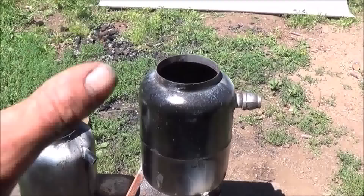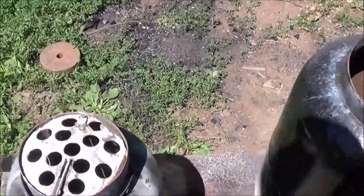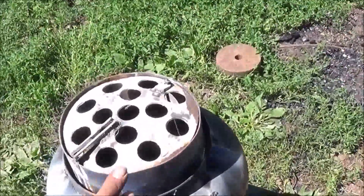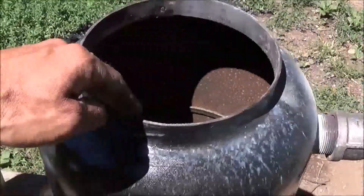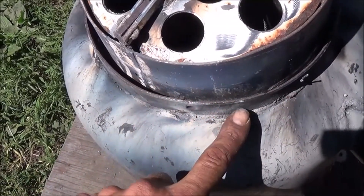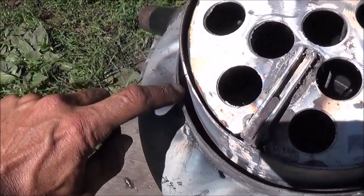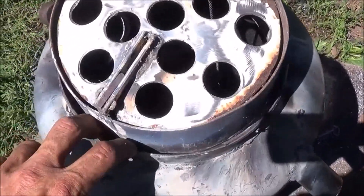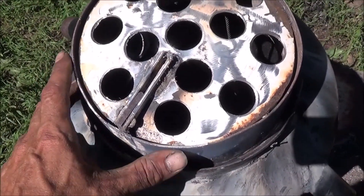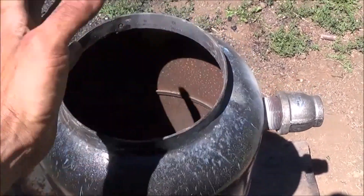We've completed the upper. I showed you how it's sitting down inside of each other. Now I've completed all the seal that we needed to make a nice seal between the upper and the lower. You can see this rim sticking up right here — that was the old ring on the bottom of the propane tank. The reduction zone itself slides down inside of that ring. This ring's lip fits right here. You can see this gap that I've left — that's another one of the rings from the bottom of the propane tank. I've just expanded it, made it wider, and it allows for the ring from this one to sit up inside that groove. We'll put some oven and stove door rope inside of there and that'll give us a really nice gravity-based seal for the gasifier so none of the smoke can get back out.